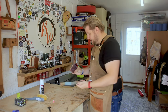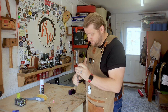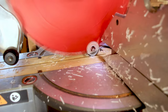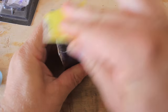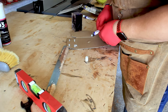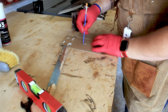First thing on the list is to stick these together somehow. This has got a very rough end from where it was turned, so I need to chop that off and key all of the surfaces so I can stick that together. Normally I use Gorilla Glue, but I've got some Everbuild two-part epoxy here which should work perfectly fine. I've checked with some experts on this.